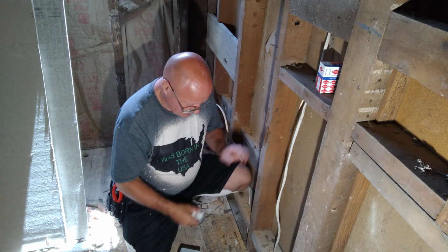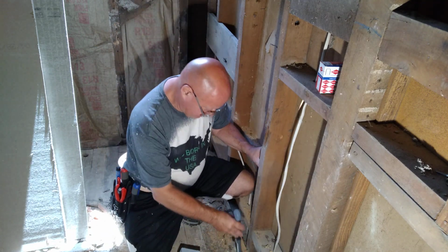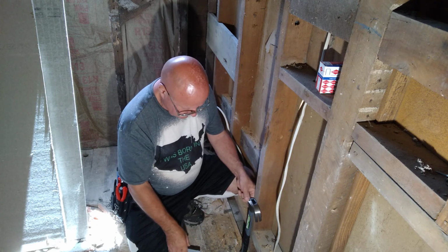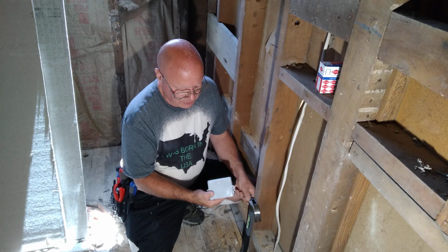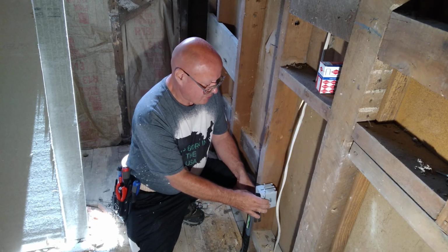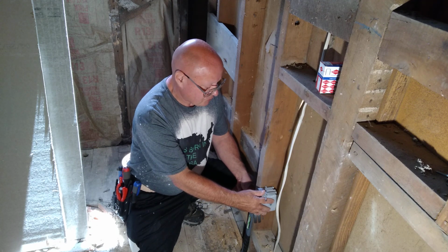Alrighty, so the standard for mounting a box is using a hammer handle here on the floor. And you'll see this little nub here. That's your 1/2 inch mark for your sheetrock. So you put it on your stud like that, flush with the top of the hammer.